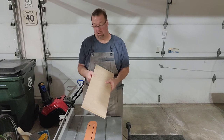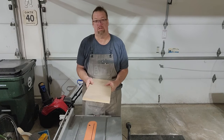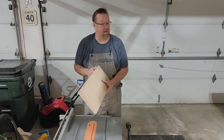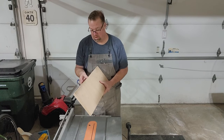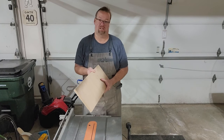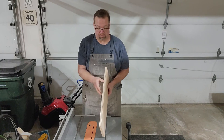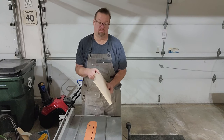What we're going to use to make our sample cleats here is three-quarter inch red oak faced plywood, just scrap left over from our laundry room cabinets. You don't have to use plywood — you can use pine. All my walls are done in pine. You can use virtually any solid wood that's not going to disintegrate under load. I wouldn't use chipboard, MDF, or particle board, but any kind of hardwood, pine, or quality plywood will work fine.